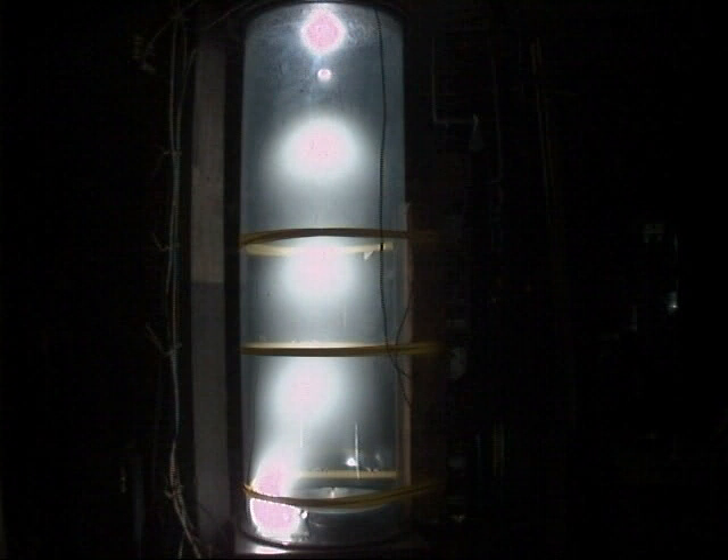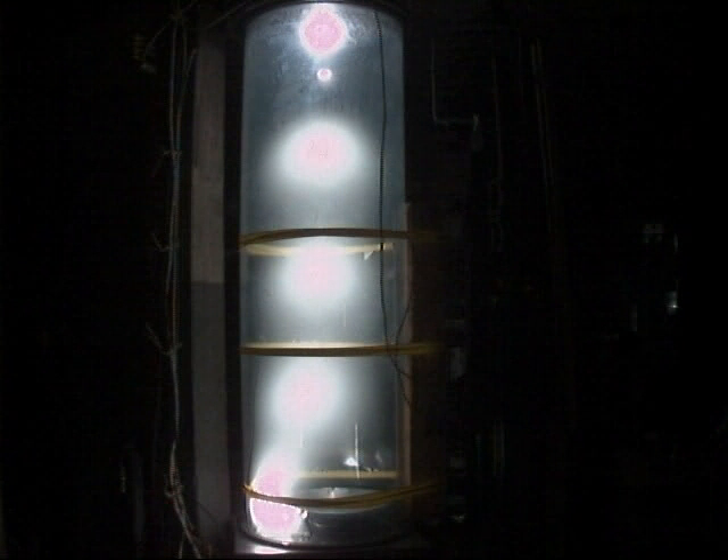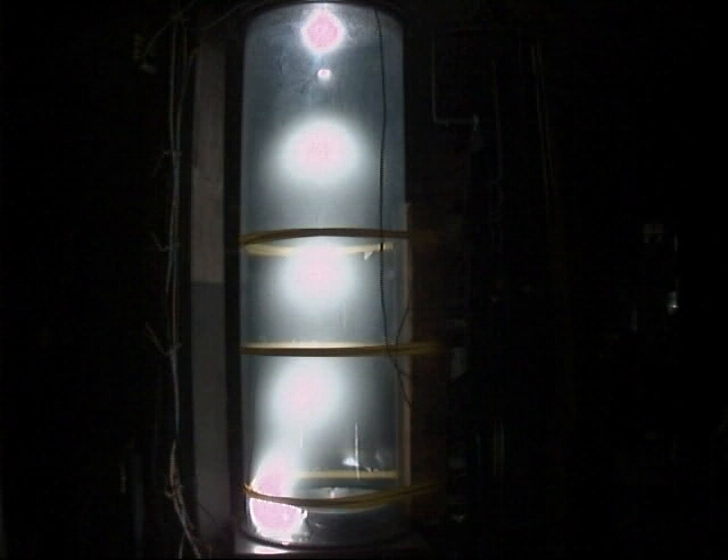A little bit of torque. I don't want to strike it any harder and screw this up. Three distinct balls were formed in there. Large striations — round striations, but nevertheless striations. There is contact between them, however. I can see a little flutter. There's a space clearing now. Four and a half amps. 85 millitorr — the pump is holding up with this beautifully.